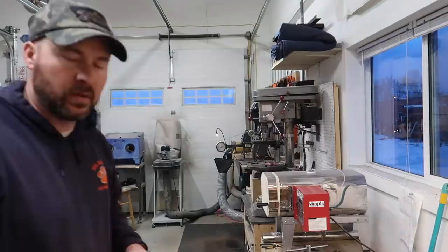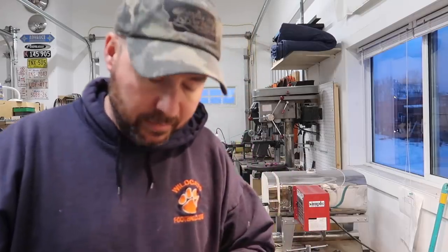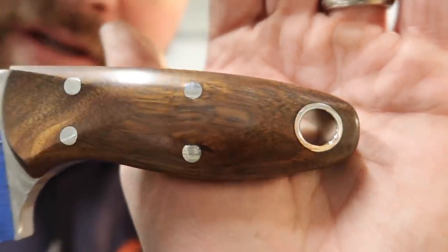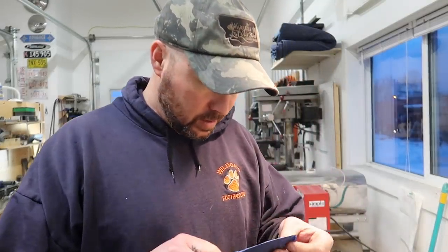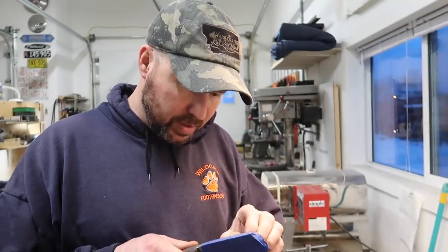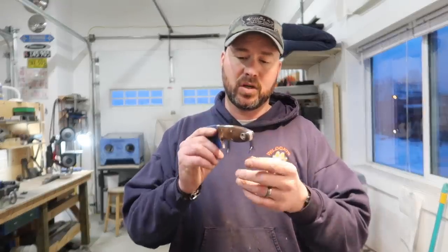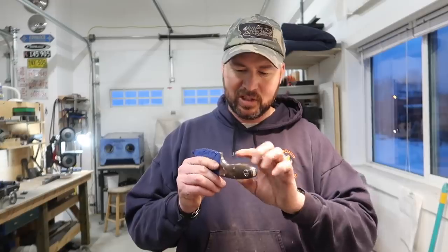Get a little bit of black compound on there, then get a clean cloth and just kind of stick it through. For some uses in the shop I like to buy these rags from Costco — you can actually yank on them pretty hard. That looks pretty good. Nice and clean, nicely finished off — I think that's bringing us very close to the end of this build. Let's take this tape off. I've only got the blade to about 220, so I'll put on a 600 grit or higher belt and just do real light passes on the contact wheel to refine the grain a little more, smooth it all nice, and then give it one more quick little buff.